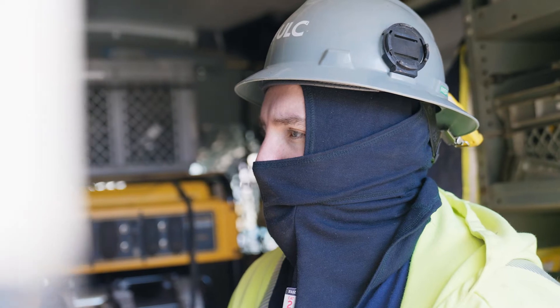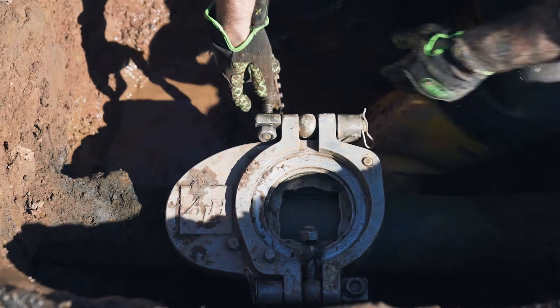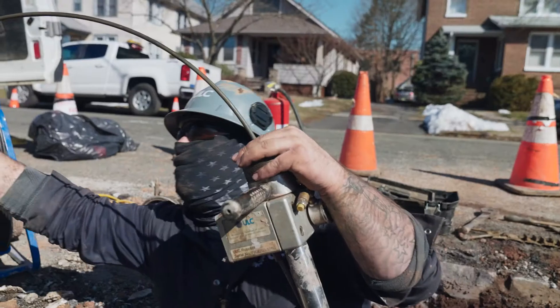The work is done live using a no-blow system, so the pipeline will be live. The ALH-1 system is a sealed tapping unit, and our system is also no-blow with a series of packing glands that we launch the camera through.